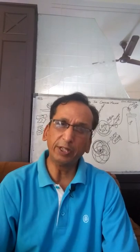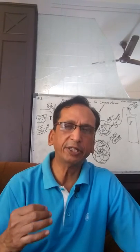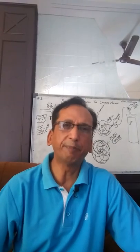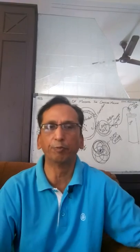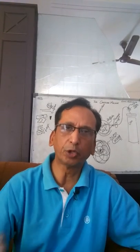Good evening, this is Sunil Bhatnagar, presenting a video on the flow of material through a carding machine. Carding is said to be the heart of spinning — if carding is done better, then half of the spinning is over, so maximum efforts are put in the carding department. The objects of carding are: to open the material, to clean remaining impurities left by the blowroom department, and to form a suitable package in sliver form so it can proceed to the next machine.